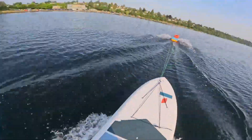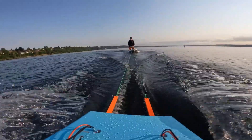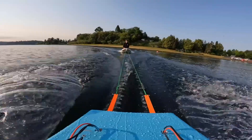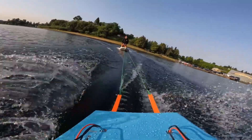The paddleboard is cruising, but I'm not sure this is top speed. Maybe the propellers just come too close to the hull. The flow is separating from the bottom on the back of the hull, and then the propellers start to ventilate once the flow separates.